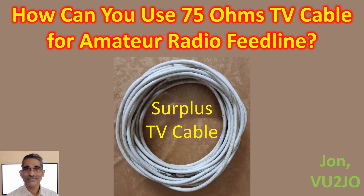In those days, I was not aware of 50 ohm cable and I was using a horizontal dipole tied onto the top of coconut trees using the stone throw method. 75 ohm cable would have been a good match for the horizontal dipole, which would be sagging in a V pattern due to the weight of the coaxial cable attached at the centre without any support in the middle.